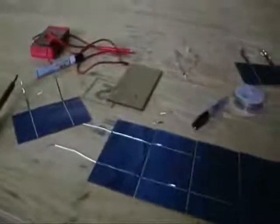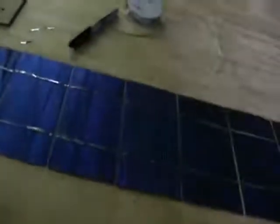I've been working on these cells and figured out the key to tabbing them together. You really need a good soldering iron — mine's only 30 watts, but you just have to be real patient. I only have a few cells out here so I don't risk breaking all of them if the table falls. I'm eyeballing the alignment and it seems to work — I was going to draw dots on a board but lining it up with the cardboard that came with it works fine.